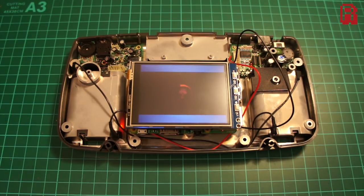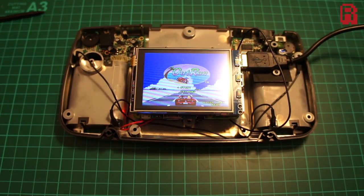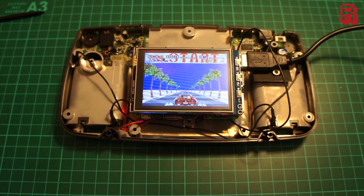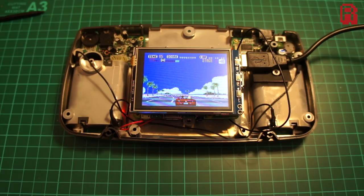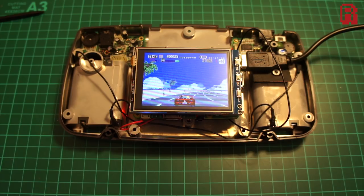Let's pop the memory card in and try again. This time we get the white screen initially, but then it boots into RetroPie. The upside down screen is a config issue which is easily fixed by SSH-ing in over the wi-fi. I plugged in a Mega Drive controller, fired up a game, and it's all working beautifully. Most importantly I'm not getting the little lightning symbol to suggest there's not enough power going to the Raspberry Pi. Our Raspberry Pi Game Gear is now powered by the original power board. Let's extend this success to the sound board using that additional 5 volt output.